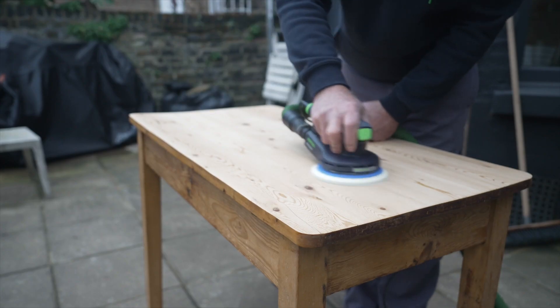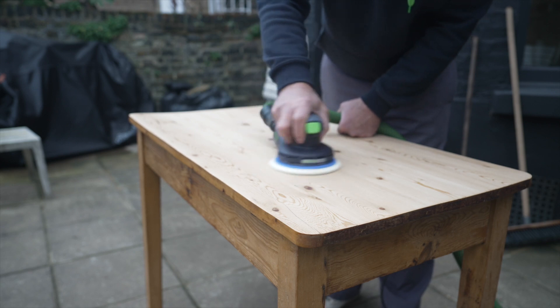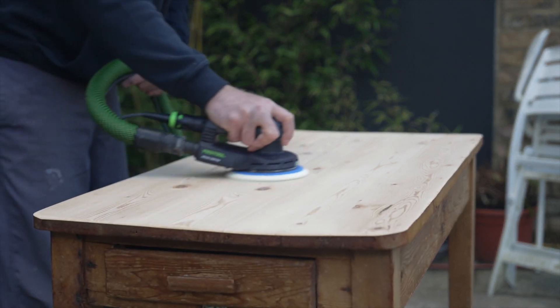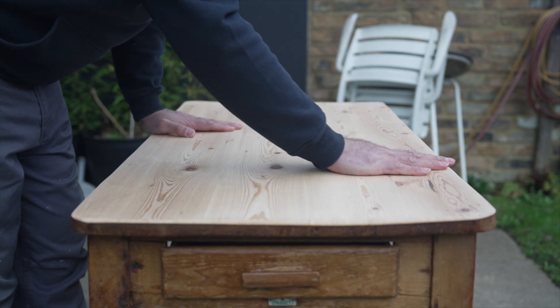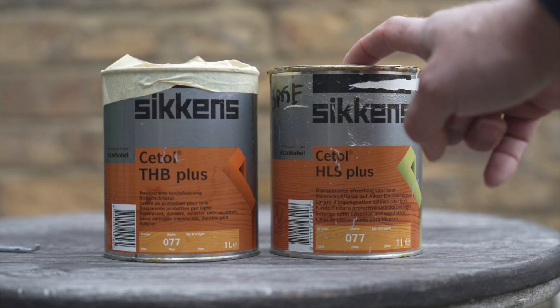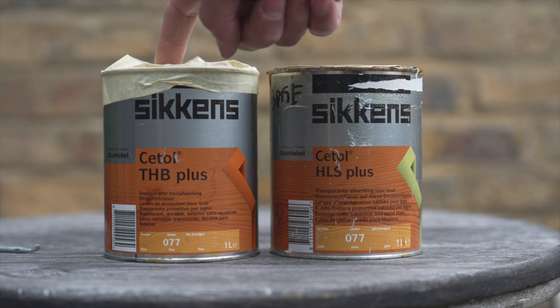Because you're stripping off so much top surface, you're going to get a lot of dust — there'll be all kinds of things mixed up in that. If you possibly can, try to use a vacuum cleaner connected to your sander, no matter what sander you're using. Or you could do it outside. If you haven't got a vacuum cleaner and you're not doing it outside, absolutely wear a mask. To be completely honest, I have a sander, I do it outside, and I wear a mask too.